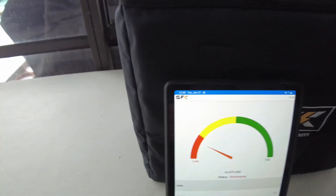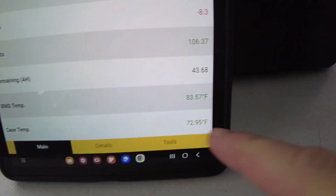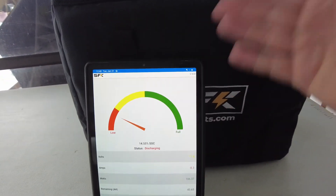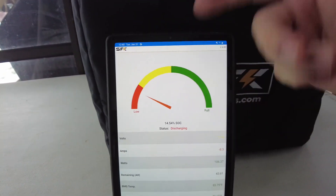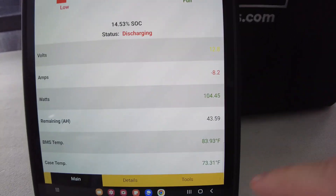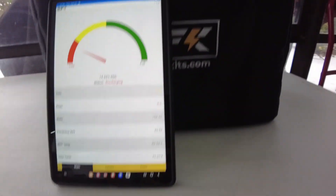It's about 12:40 now, and around 12:30 I checked and we were at about 70°F, which is above the 68°F target the switch is supposed to regulate to. I think the thermal probe for the switch is higher up on the battery, while the BMS probe is lower, closer to the cells where the heating pads are, so I fully expect the power to throttle down as the switch regulates the temperature.